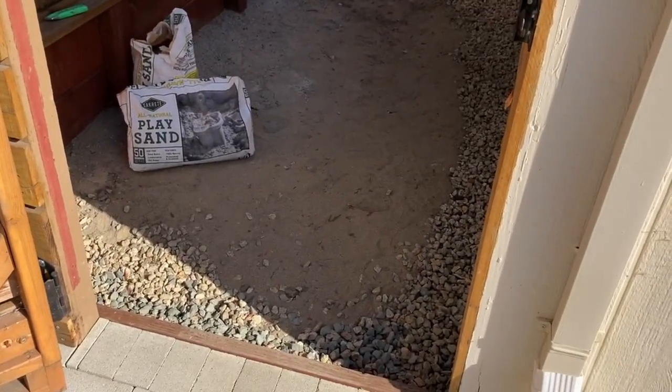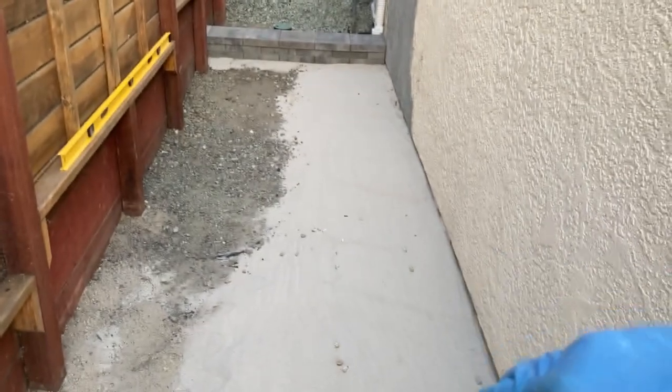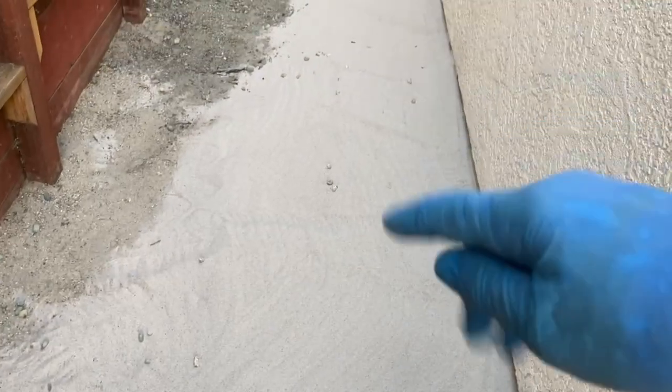I've got a few rows of brick laid. What I'm doing is spreading sand on top of the crushed rock and then sloping it so it goes up that way — it'll go down towards the driveway, and from the house sloping it out towards the fence. It really doesn't matter because there's a French drain all the way, so any water is going to go down through the French drain. I'm using my float or trowel to spread the sand.